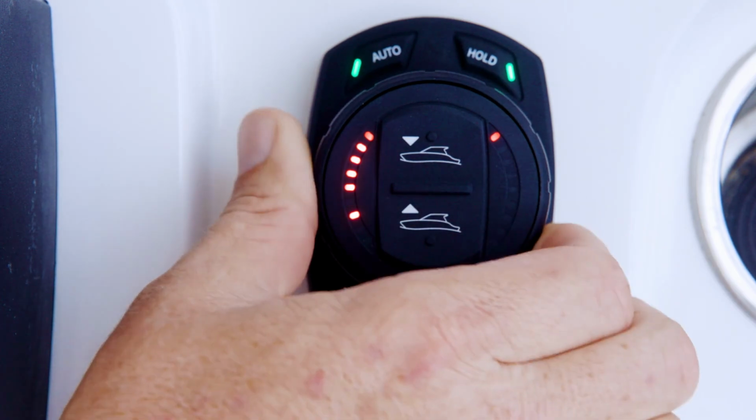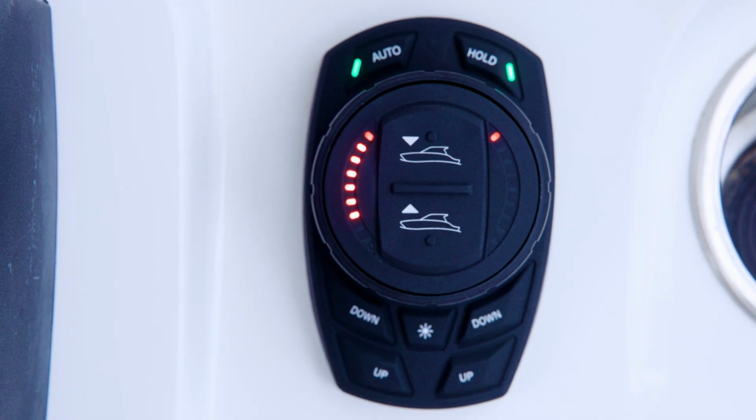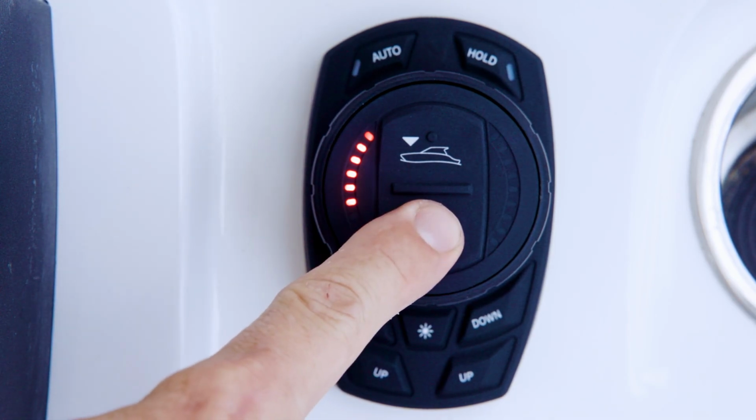Turn the dial counterclockwise and release. The 7th left-hand LED will begin flashing, indicating that the throttle on-demand pitch can be activated or deactivated. This function is for Mercury digital throttle and shift equipped vessels only and will factor throttle lever position into the pitch control software when activated.